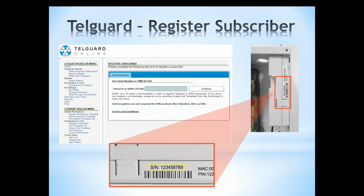Now, once you have your unit and you have it mounted, and we've tested the signal strength, we need to register with Telguard. So what we have here, we're on the Telguard's website, and under the register subscriber, you will enter the serial number of the C1M1, and it's located on the side. It's a white barcode sticker that has the serial number and the PIN number. So right here we have our serial number, and that gets entered in this field here.